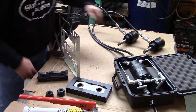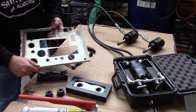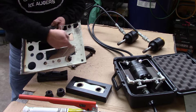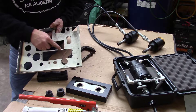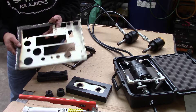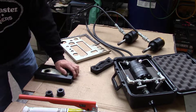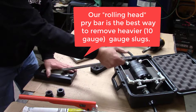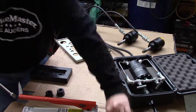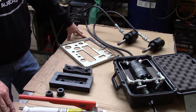Turn that panel sideways so you can see the perfect alignment with your mounting holes for your device and a perfectly square opening. Notice how well it was able to punch that close to another opening — there's a little deformity there, and we always recommend keeping at least a half inch around your opening. But there it is: a perfect opening, done that fast. Hope you enjoyed the video. We'll have some live feeds on YouTube with more demonstrations of our equipment and how it can be a real time saver for your panel fabrication needs.